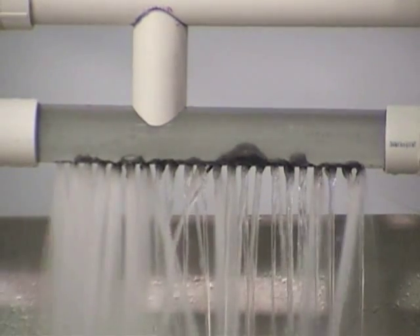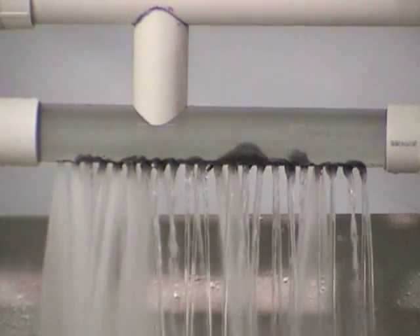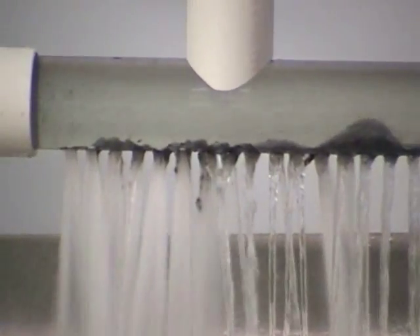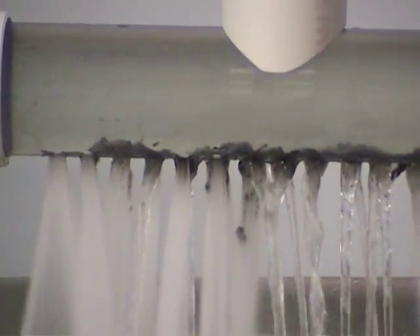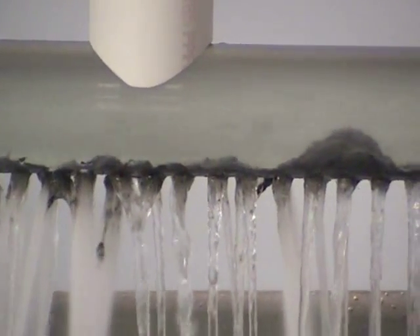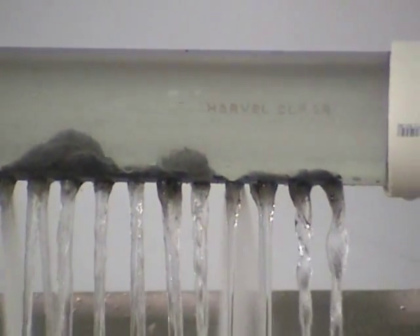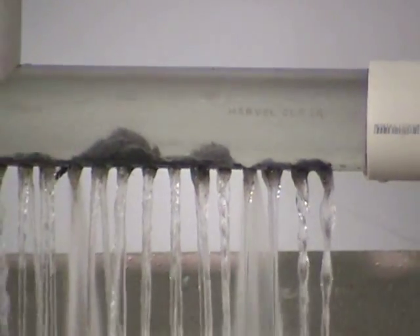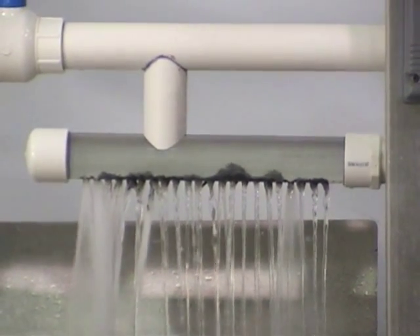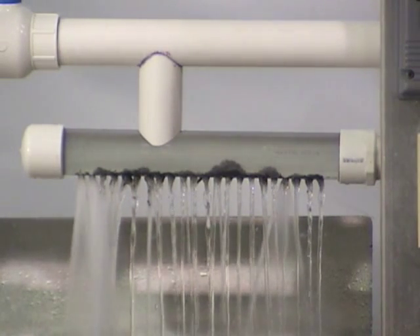I refer to these systems as wastewater discharge systems, not wastewater treatment systems. It's very important to use the pressure filter on a pressure system — don't try to substitute that with other filters. We still recommend the use of filters upstream of pressure filtration, such as gravity filters in the septic tank. But you can't absolutely protect that system without filters in the proper place — in this case, on the discharge of the effluent pump in the pump chamber. Many codes and state regulations will actually require filtration from the dose tank.